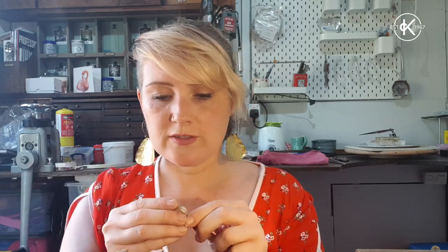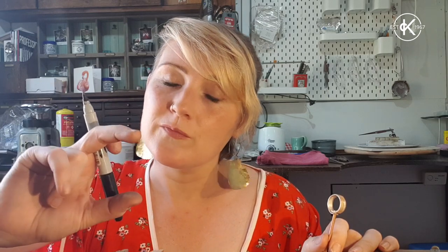Then you're going to slot the tubing onto your stack and mark it where you want to cut it. The length needs to be exactly right for the stack — normally it needs to be about one millimetre poking out either side, so two millimetres longer than the depth of what you're trying to join together. You could get a pair of calipers or a vernier gauge and measure it precisely, or you could use a ruler, or you could just do it by eye like I do.